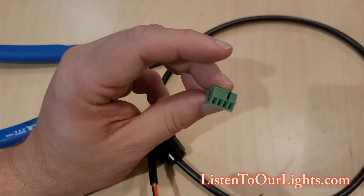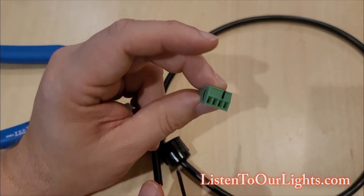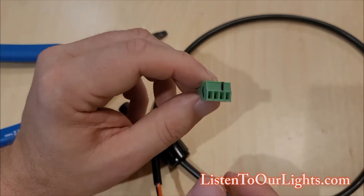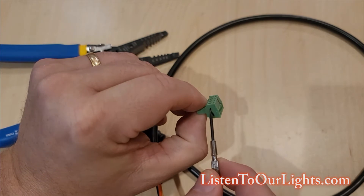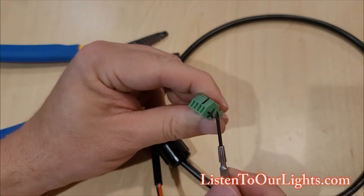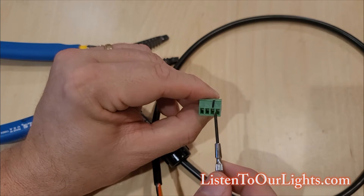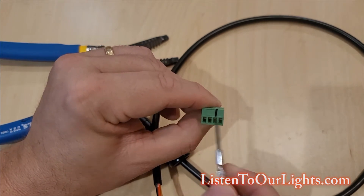Typically, your controller will come with 4-pin Phoenix connectors, but we're only using 3. So you actually want to look at your controller and see where the pins are. This first hole is minus, so I put the minus or ground on the side — I put a little minus sign. Then all the way on the other side, we're using it for V plus, so I'll put a plus sign on the side. The only other one I need to know is which one's data, and it's this one. And then this one is unused.